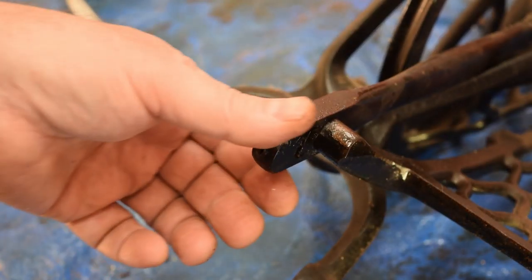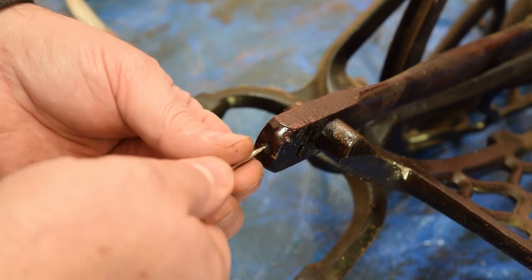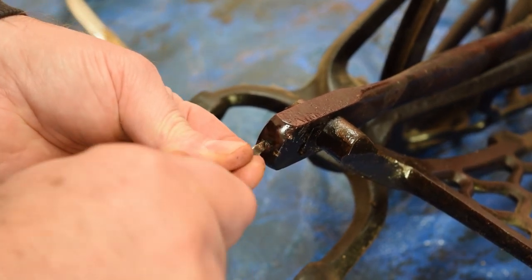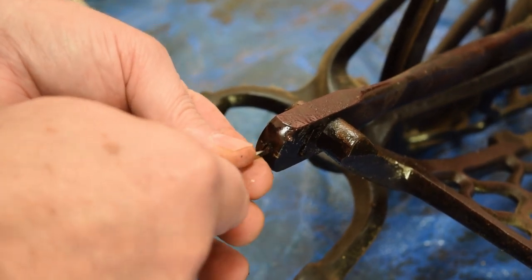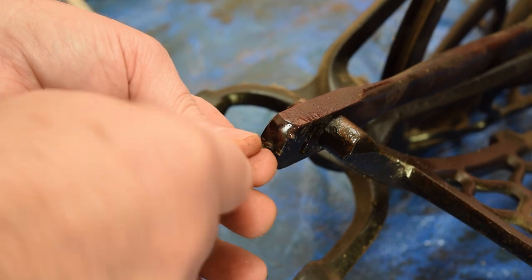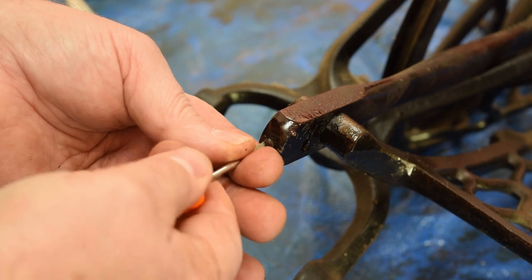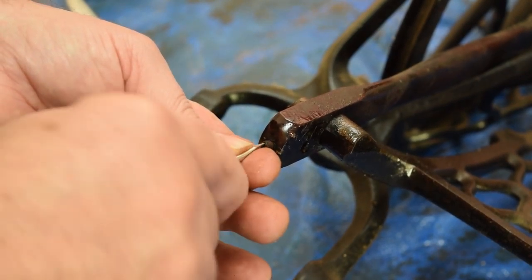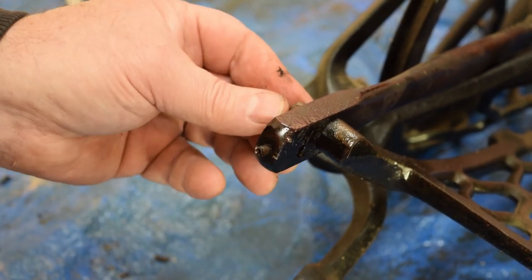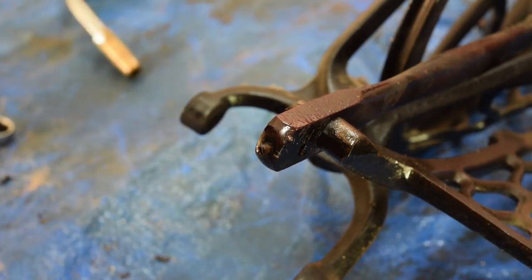Okay, we're looking now at the very bottom end of the wooden pitman arm. There's a little set screw in here that maintains the tension of the pitman arm on the pivot arm. And I'm very carefully backing this out to loosen up that fitting. If this screw was rusted or rotten, you'd want to be extremely careful. There, I think that's fine for right now for what we need to do. The next step that we have to do is drive the pin out. So for that, I'm going to flip this back upside down. We'll try to drive out that pin.